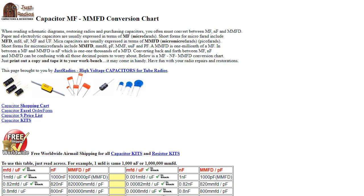Hey, welcome back everybody. Part 5 here in this series, and I thought I'd start out with a few corrections I need to share with you. Some very astute, loyal viewers pointed out a few things to me, and they are absolutely right, and I was in the wrong on this. One of those was the MMFD reading. Remember, we had a 68 MMFD capacitor and a 24 MMFD capacitor in this unit.